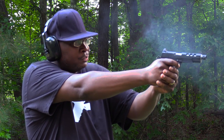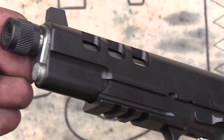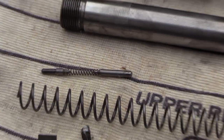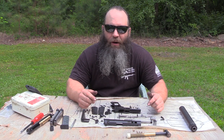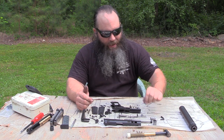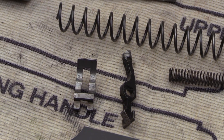If you've got any questions about how that works, my buddy John Travis, a 1911 tuner, wrote an article on Rainshot about the reduced radius firing pin stop. Dan Wesson does ship the gun with a barrel bushing wrench. The barrel bushing was not tight enough to where I really needed it — I was able to get it off without that, but it is very well fit. They're still not kinking the plunger spring, so when you take that thumb safety off, that plunger spring tries to get the hell out of Dodge. If anybody at Dan Wesson is watching this — how about kink these plunger springs a little bit? Because I am tired of looking in my carpet for them. The sear and disconnect both look really well.